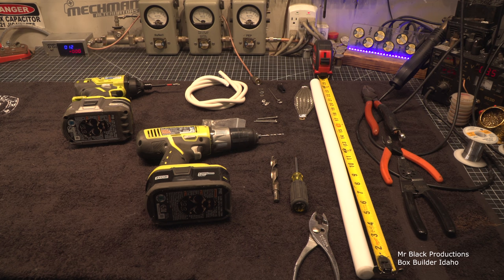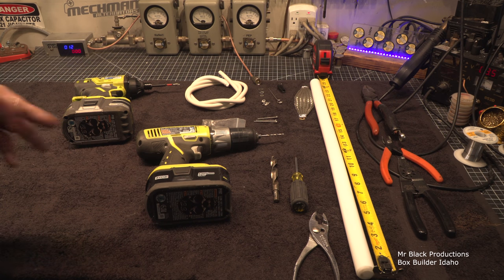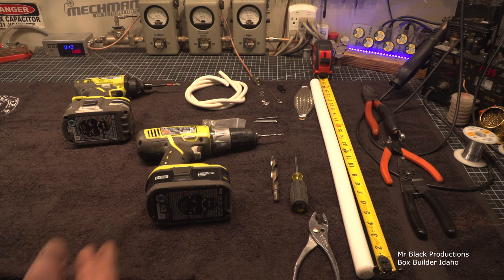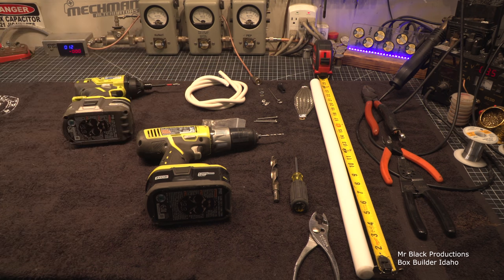So, out of happy go lucky mode, and let's get serious here for a second. This is actually a really, really important tool to have, and I'd like to explain how to use it, ish. This is the last thing that you do before you stick your hands inside of any amplifier with high voltage: you make sure it's dead and grounded. Now, you guys don't want to see me take this old dirty wand that I have and push it around on the inside, but you've got to do it.